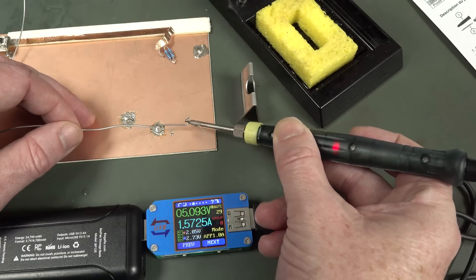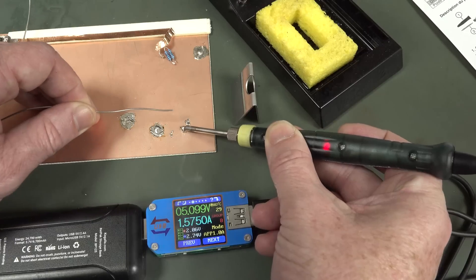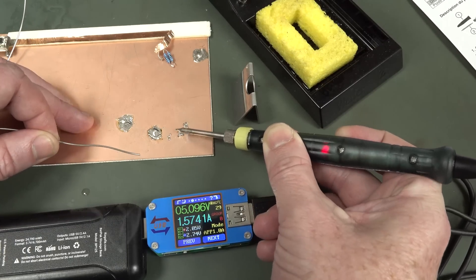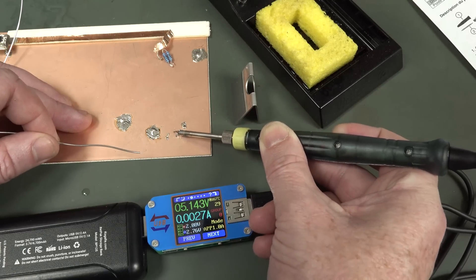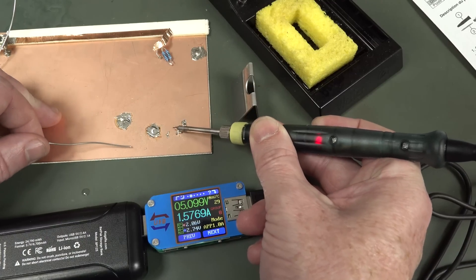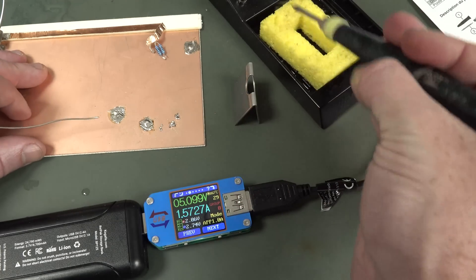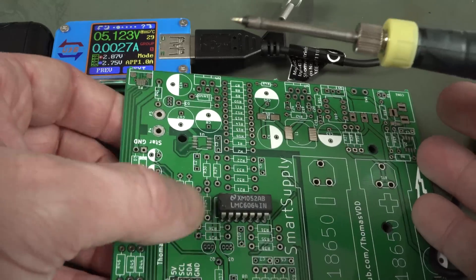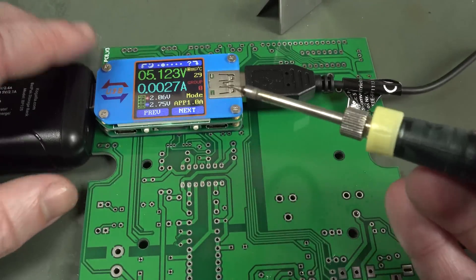Let's try the ground plane test. I don't expect much — it might bite a little bit because it's got such a high temperature. But look, the flux is just vanishing. It did initially bite — that's because of the high temperature — but it certainly can't sustain it. The poor thing's trying, but now it's switched off. I don't expect it to do a ground plane like that — that's not its job. Okay, let's see if we can solder a standard DIP package on a double-sided PCB. Nothing particularly hard. Let's give it a go.